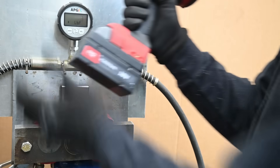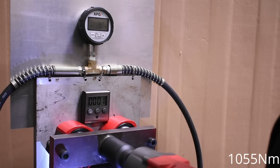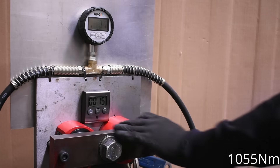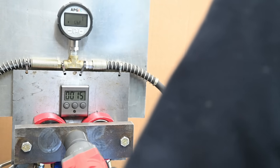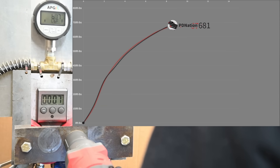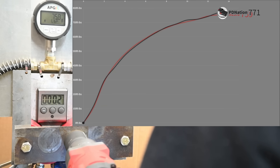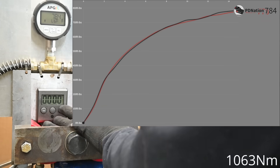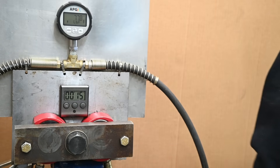Back to the dyno with bigger demands from the battery: the Milwaukee M18 Gen 2's best run was 778 foot-pounds with an XC 5.0. With the PD Nation battery it makes 784 foot-pounds — about the same, maybe a tad more at the end. Overall equal, which is what we'd expect from a high-output 3.0.